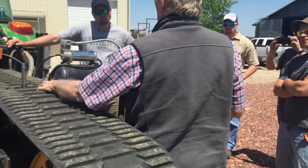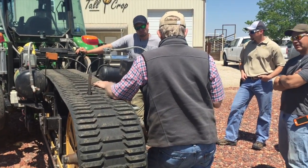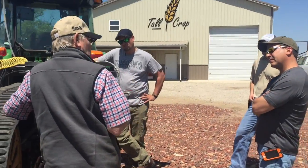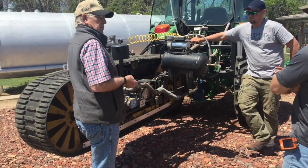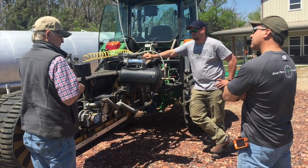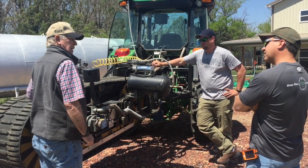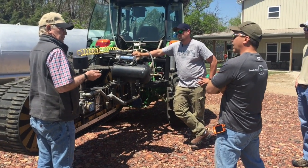Depending on a number of things — for instance, if you were doing one acre grid, you need more dirt because you're going a shorter distance. So you use a couple of big tips if you're doing a two and a half acre grid. Two of these tips equals one of these. So we could either use one of these, or if it's in sticky clay, wet type soils, I'll put on two small tips because they'll release a lot easier.